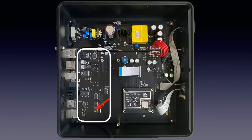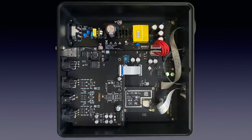A Philips chip takes care of the I2S interfacing and the AES-3 output is transformer decoupled. Looking at the top board we see the ES9038 Pro DAC chip, with the crystal clock on one side and a voltage regulator on the other. The analog signal then passes to one OPA1612 operational amplifier per channel for the balanced outputs and a single OPA1612 for the single-ended outputs.